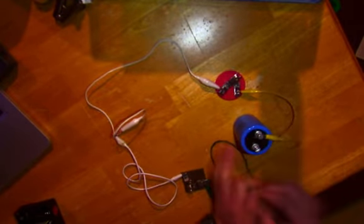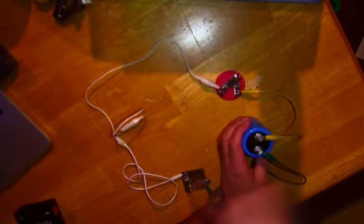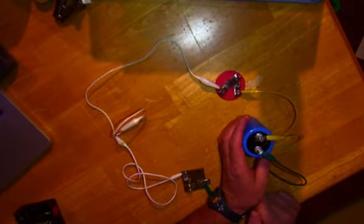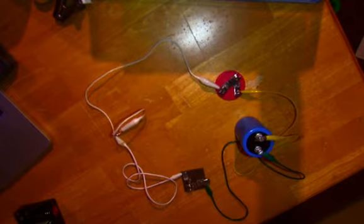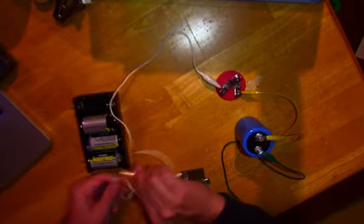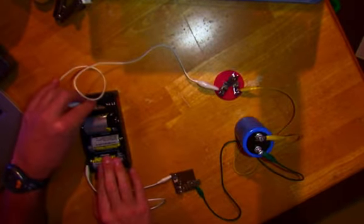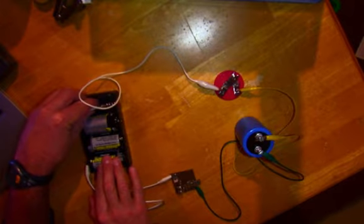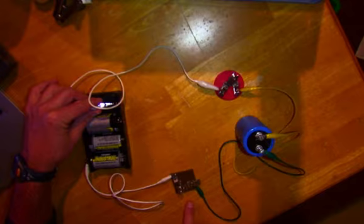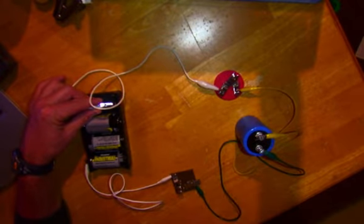So let's go ahead and test circuit A. We connect one end of the wire to the one terminal of the capacitor and one wire to the other end. And notice, what did you see? What I noticed is that the bulbs were unlit. This is circuit A. For circuit B, we need to pull the battery pack back into the loop. So I'm going to go ahead and connect one end of the wire to the blue bolt, and on the count of 3, we'll connect the other end of the wire to the red springs. You're watching for the bulbs. 1, 2, 3. Now notice that the bulbs lit, but they didn't stay lit.